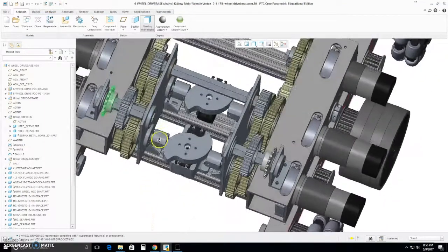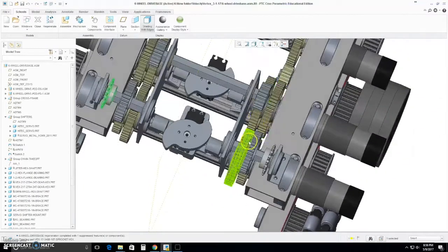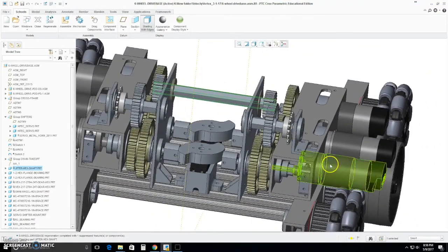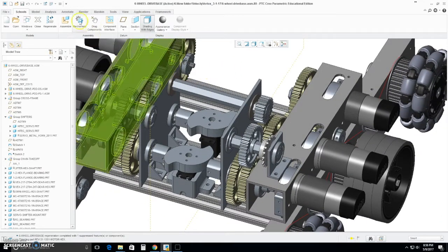And then these rear 2 motors in their second output are geared together across to the other side to combine in with the motors over there to give this center winch either 3 without this or 4 motors of total lift power. For the Velocity Vortex Challenge, we did have to take out this 4th rear motor to put onto our turret, and so we only had 3, but the design is capable of all 4 motors.